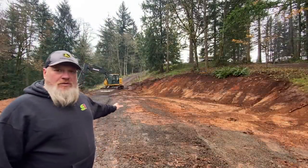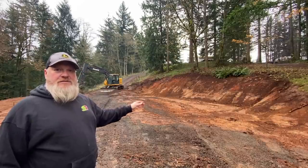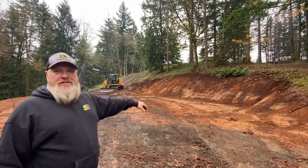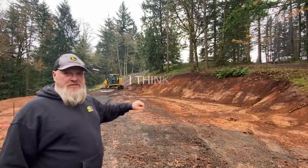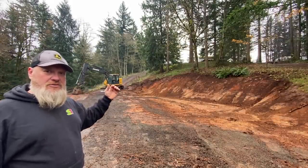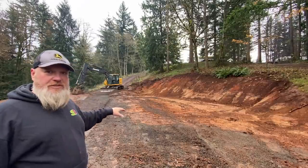So what I've laid out is 40 feet by 42 feet. And what this is gonna be is a shipping container, wood frame, metal-sided roofed hybrid shop. So I'm going to put a shipping container down that side, and likely I'm going to stack two shipping containers on each side, and I'm going to have a 26-foot open floor in the middle, which will be concrete.